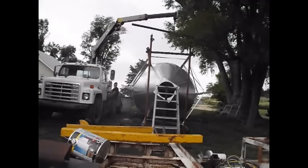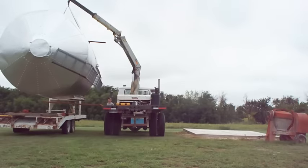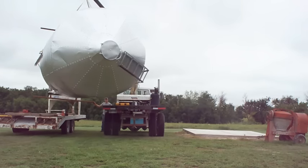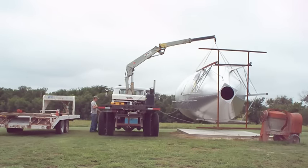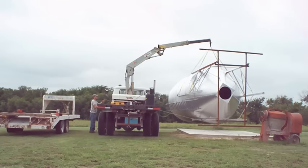So then I was doing the math, double-checking everything, and I realized the grain bin was actually three feet longer than what I first measured. So I couldn't lift it with the crane to erect it — that means I'd have to tilt it. I ended up putting what I guess you'd call a base on the bottom of it. I came up with the idea of lifting from the side using a winch line and rotating it up instead of just lifting it from the top.